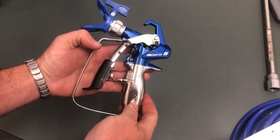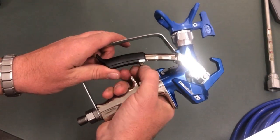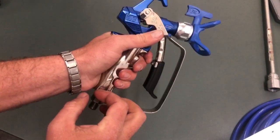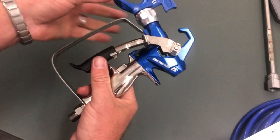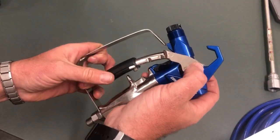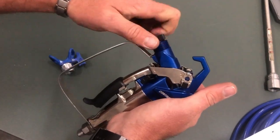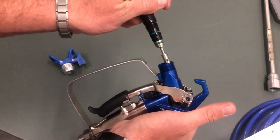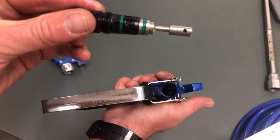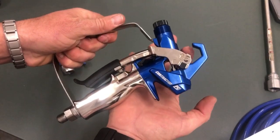This is a bit of a close-up of that Contractor PC. It's a beautiful machine handle. You can adjust the trigger just by undoing and tightening that screw. Your safety is very easily — ambidextrous might I add, because I know there's a couple of lefties out there. To change your needle seat, just to give you a little bit of a close-up of that: you depress those two buttons you see there — it's clearly marked. You push that, it completely disengages the trigger and you can unscrew this. That's what the whole needle set looks like and you can have one or two of these spare. It will save you a lot of time if you run into hassles. There's the inside of the machine — do that and this is how easy you get the trigger back in.